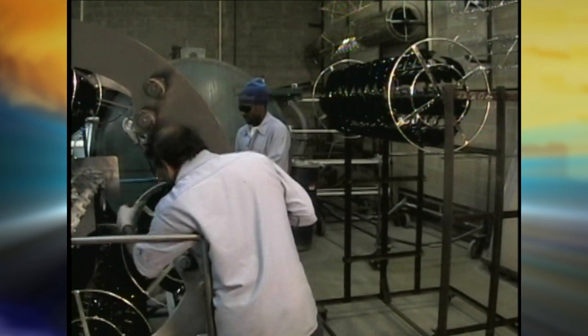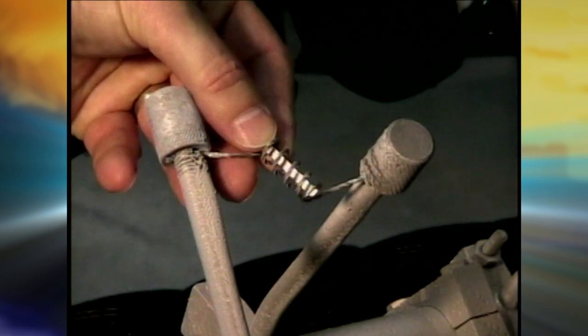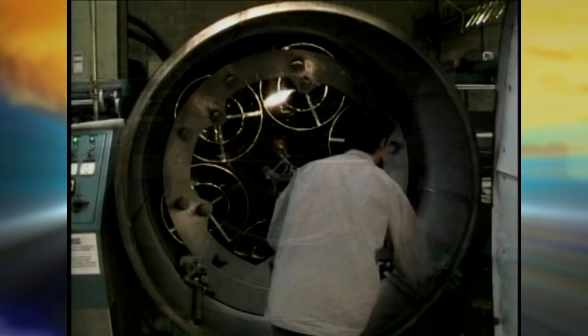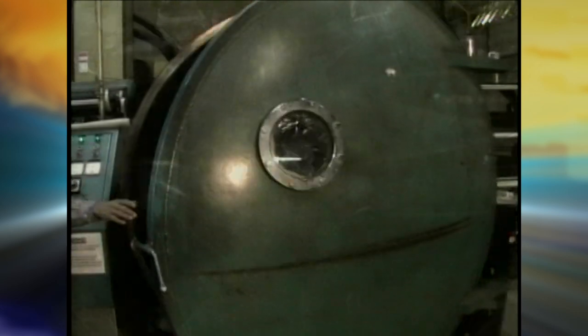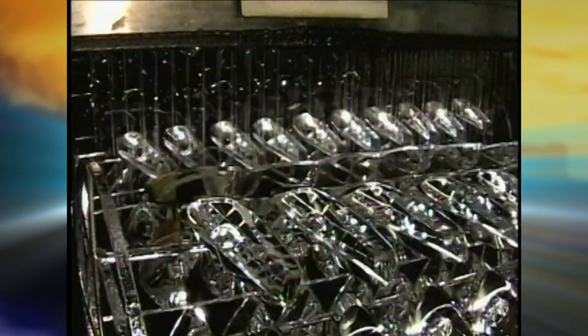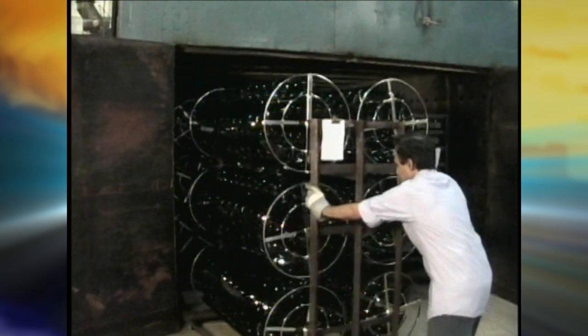Next, the parts are loaded onto a large rotating carousel. Small aluminum pellets are inserted into a tungsten filament that sits inside the center of the carousel. This is loaded into a large pressure chamber, and the air is pumped out until a specific vacuum level is reached. The tungsten filaments are heated, causing the aluminum pellets to evaporate into the space inside the chamber. As the parts rotate, they accumulate a thin layer of suspended aluminum particles. The parts cool and are sent back to the clear coat process — essentially, the aluminum is sandwiched between two layers of clear coat. After a final 90-minute bake in the oven, the part is done.